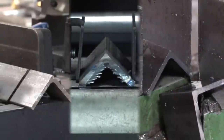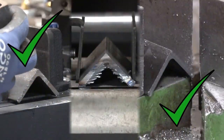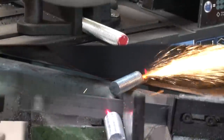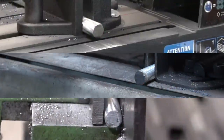This is exactly how they came off the saw. We have a perfectly clean cut on the Evo saw, a perfectly clean cut on the band saw, and on the abrasive saw we're going to need some cleanup — a little bit of post-cut action. As for cut quality on all-thread: I've never seen a saw in the history of saws that cuts a perfect, burr-free, ready-to-go all-thread cut. But the band saw and the evolution saw both left nice, clean, relatively burr-free cuts compared to the abrasive saw. None of them give a perfectly clean cut on all-thread — they all need some sort of chamfering or thread finishing afterwards.